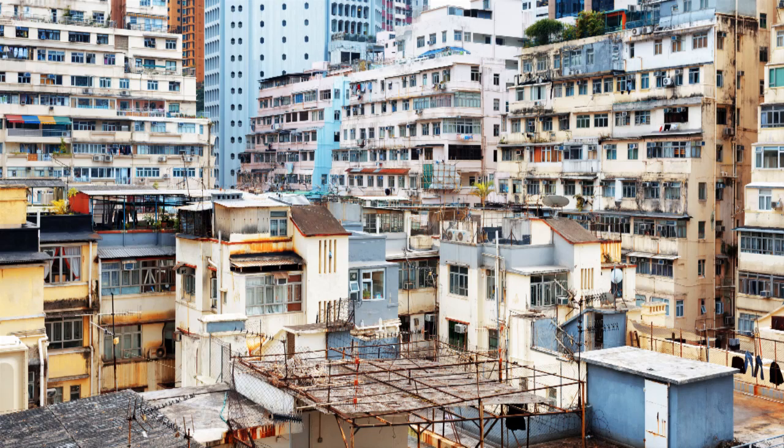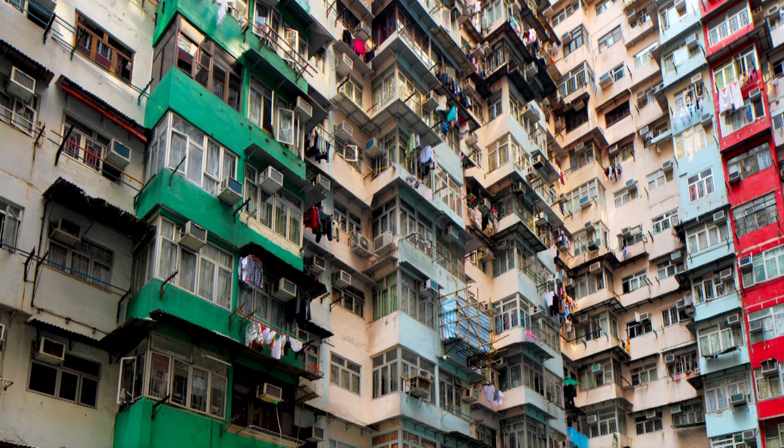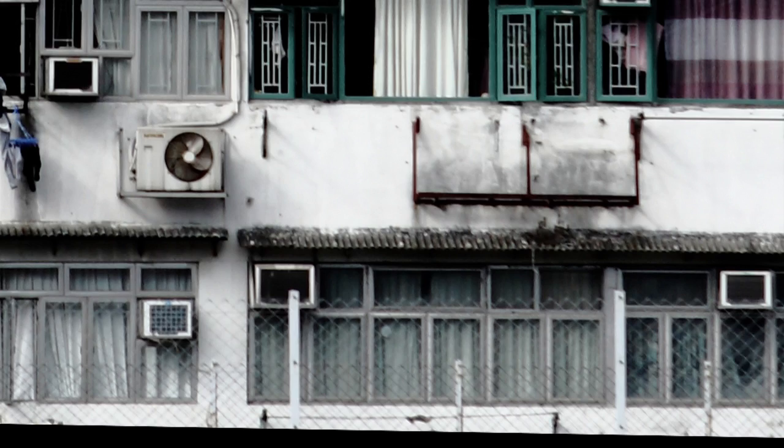In Hong Kong, there are a lot of old buildings. We have problems with concrete spalling, which means that pieces of concrete are getting loose on the surface of a building and they would fall to the street. We applied this new bendable material as a mortar on the surface of the building. So when you have a piece of concrete that gets loose, when it wants to come out, this bendable layer is going to trap the piece inside. So instead of falling out to the street, you can see that on the building surface there may be some parts that bulge out, so you can go over there and fix that part.